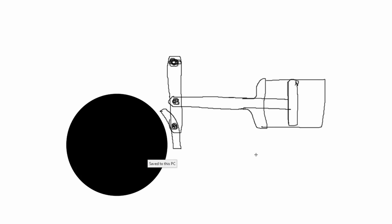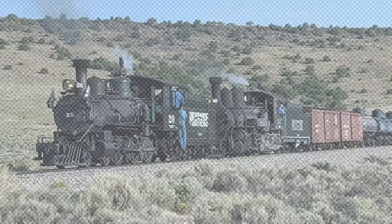There are a couple of nuances here. Why are we using compressed air specifically, rather than steam or vacuum? If you have a pipe running all the way from the lead locomotive down the train and you tried to use steam to actuate the brakes, you'd get condensation as you move away from the heat source — the steam would turn into water. We know that water and pistons don't like to play nicely.